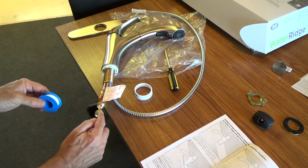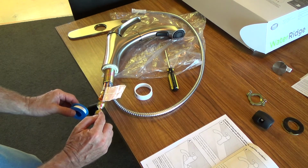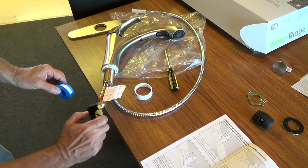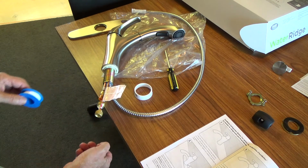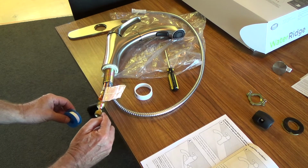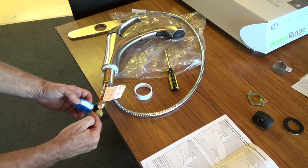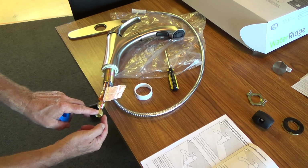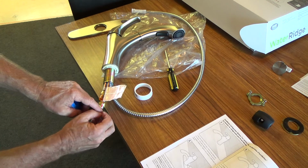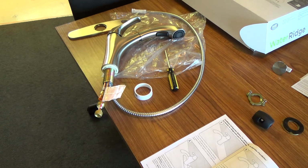Well, what you got to think about is at the end of the tape, which way is the tape going to end? You want the tape to end and break off going this direction, that way. Because then when the nut goes on there and tightens up, it's going to turn to the right. Righty-tighty, lefty-loosey, remember? So it's going to go to the right. And as your tape is going that way, it's going to bond and tighten your tape going the same direction as the nut. Because if you put this on the opposite direction, can you see what's going to happen? The tape is going to be coming up this way, and so when you tighten the nut, it's going to have a tendency to want to pull the tape and kind of scoot it backwards as you're tightening it. You're not going to get as nice and tight of a fit.